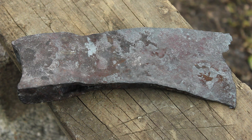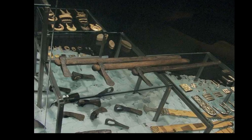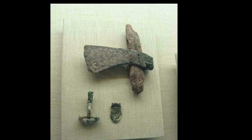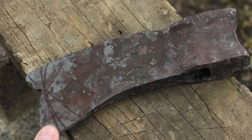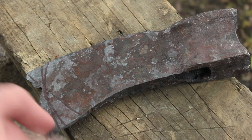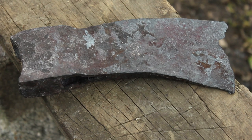So after about 18 hours of work in five separate forging sessions, I've completed the forging process. While it doesn't look strictly Viking, it does look Germanic, I would say — possibly like a Frankish throwing axe, or I think it looks like something maybe a Visigoth might have. So the next thing I'm going to do is try and bust off some of this scale on my sandstone rock, then trim off this ratty edge here, give it a little more finesse to the finished shape. I'll put a handle on it and that'll be it.